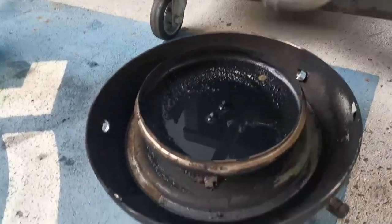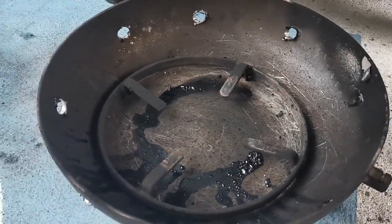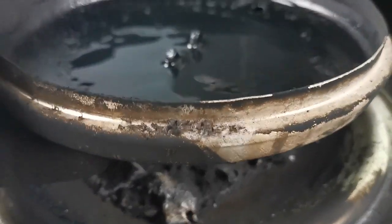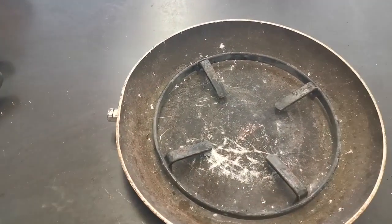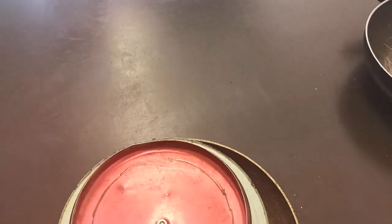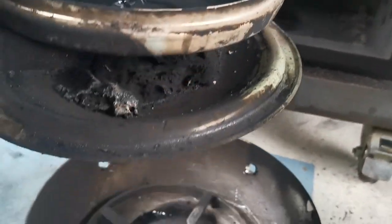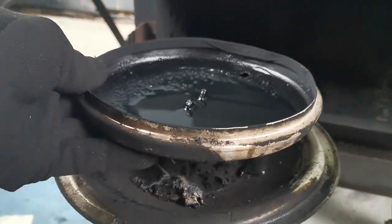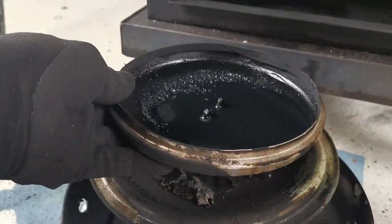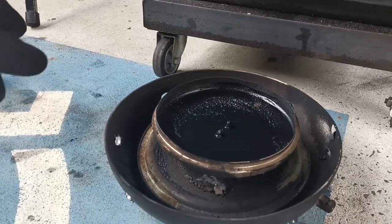This is going to sit and hang over the plate. This is an independent oil burning system by itself - I call it the triple plate system. It's got two plates bolted together and two dishes, actually old pot lids, with a pot holder at the bottom. The smaller dish sits inside the bigger dish. The oil puddles, spills through the hole, drops down to the one underneath which has ceramic wool that wicks it up, so we get really hot fire. Oil drips into the lower plate, overflows, ignites the lower plates which heat the upper plates - a really hot self-sustaining oil vapor burner.